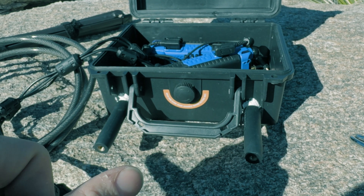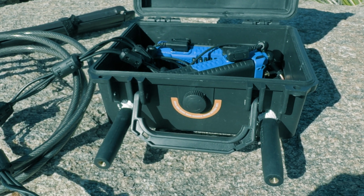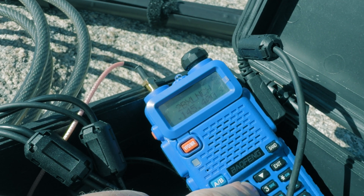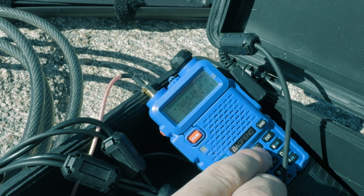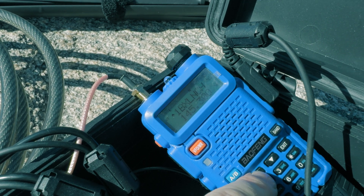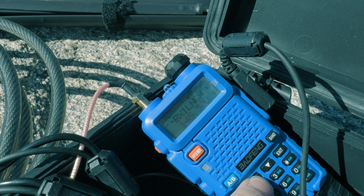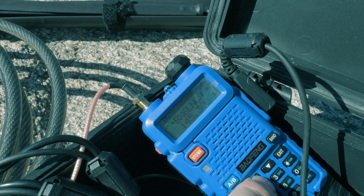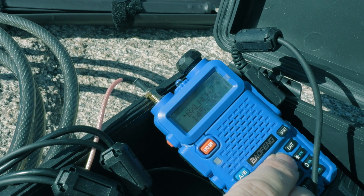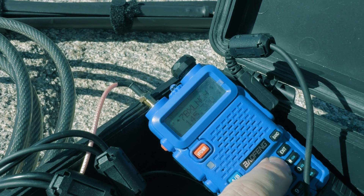If you are using a more powerful repeater, you can do split-band — I have presets for that, where one radio receives on two meters and the other transmits on 70 centimeters, which splits the frequency enough that a good radio won't be affected. Right now it's set to two meter, which works better up here in the mountains. I have a total of 24 different setups: four two-meter bands, four two-meter-to-70 cross-bands, four 70-centimeter bands, four 70-to-two cross-bands, and eight GMRS repeater channels — all on the same CTCSS tone, 1-2-3, just to keep things simple.